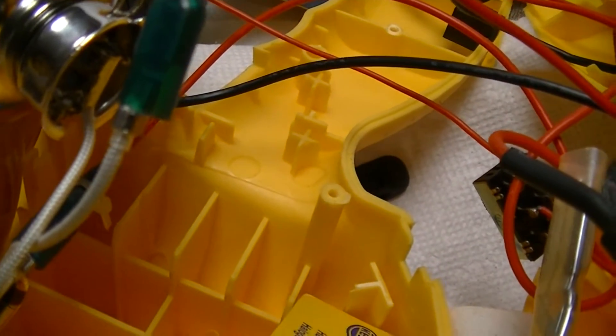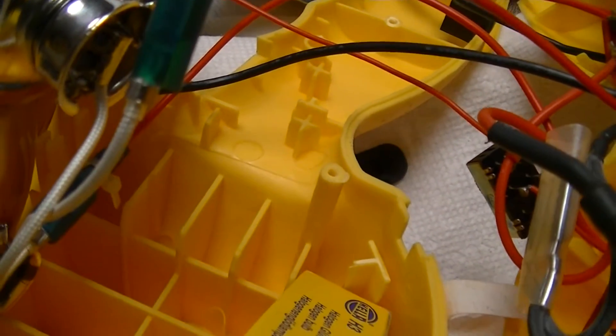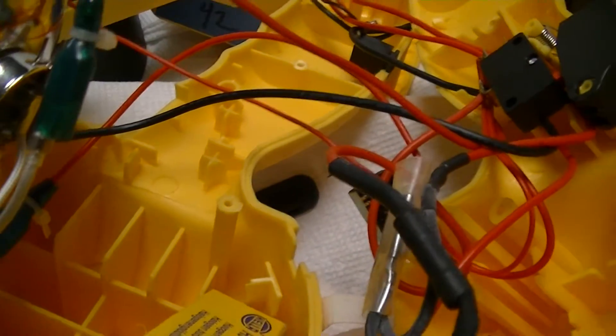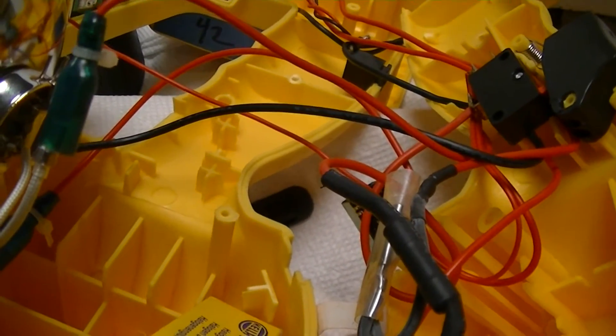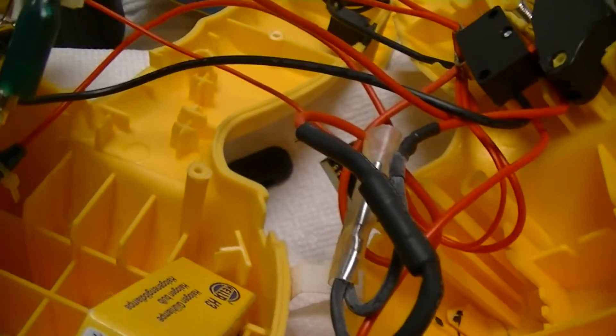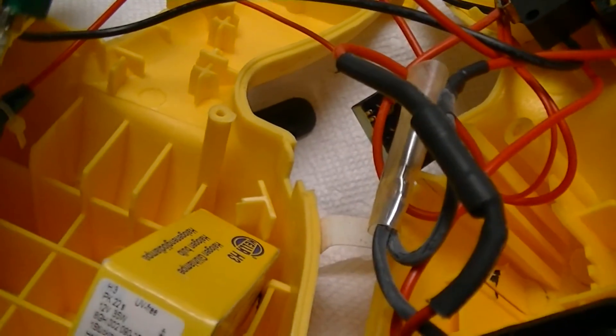These aren't the most egregious cases of overrated lamps. I had some spotlights which took little 6 volt H3 lamps — these were ultra cheap, with the light and charger retailing for about $6 circa 2004. They were marked as being 6 volt, 100 watt lamps, but they were actually 10 watt lamps. So this isn't quite as egregious, but still.